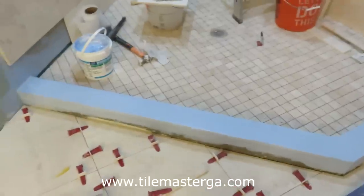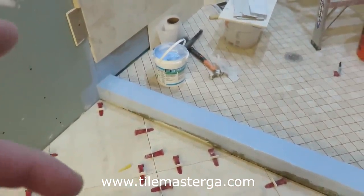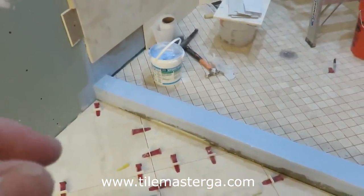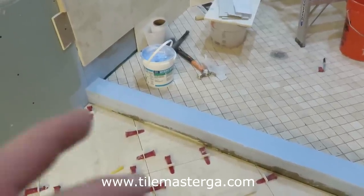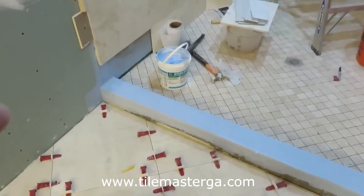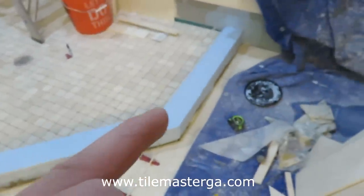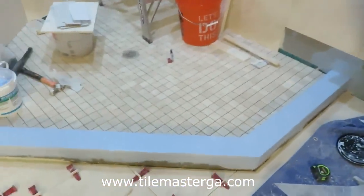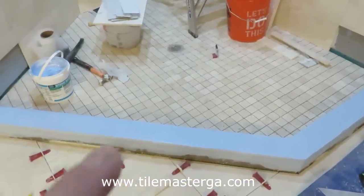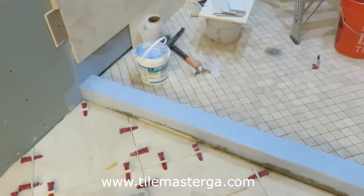So like I said, this is the major section where usually a shower starts to leak, the shower curb. This is why I really took extra step, extra time, and waited to the last moment with waterproofing it. Leaks will usually start in the corners, sections like here and over there. So those flat surfaces like bench or curb, niche, are extremely important.